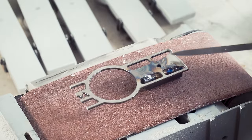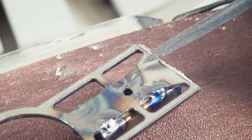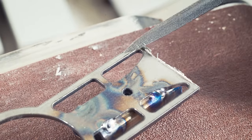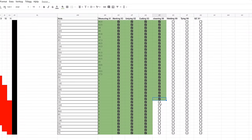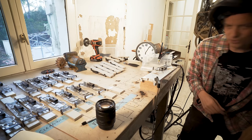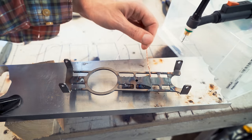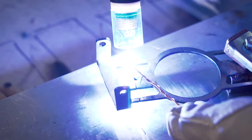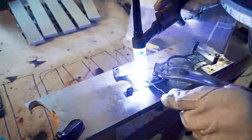There are two reasons why it's important to clean these before welding. The first is to remove the burr that comes from the hacksaw cut. The second and more important reason is to clean away the oxidation layer on top of the mild steel, to have a clean surface to weld to so the weld is not contaminated. Now we're down to the silvery color with no burr — ready to weld. Four hours later I have only the top of the last part to weld. Six welds to go. My work — oh wow, I'm so happy! This was a marathon, I can tell you.